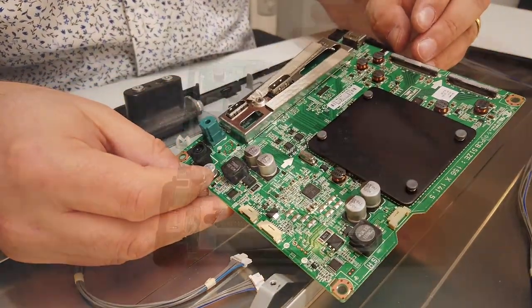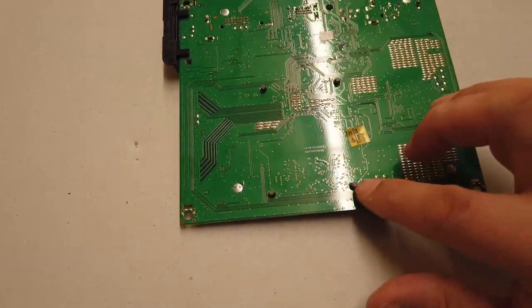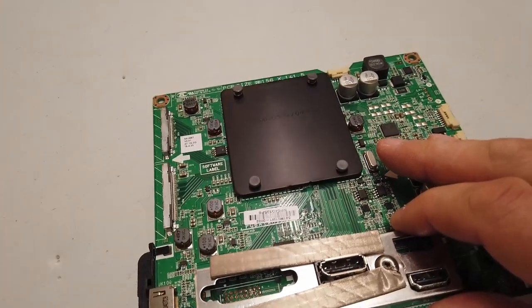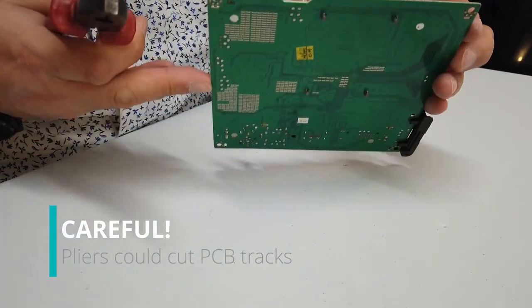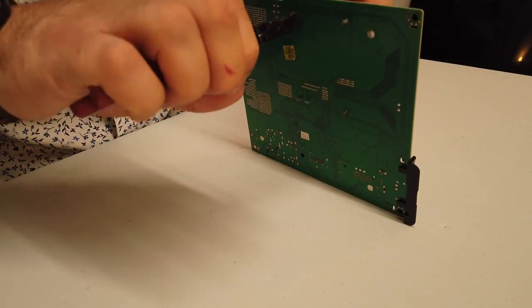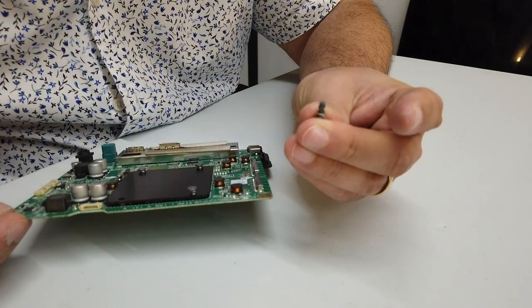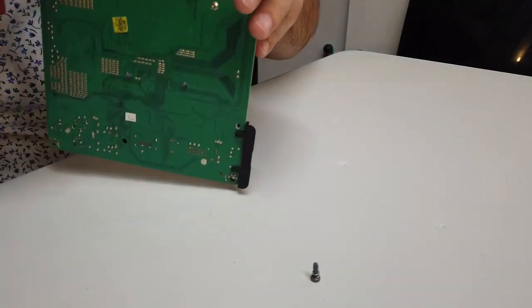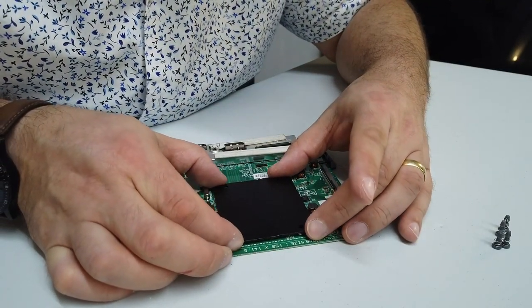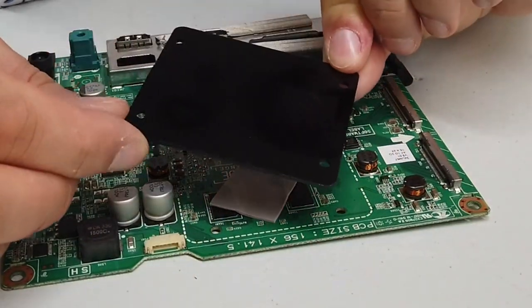Let's have a look at this PCB. This heatsink can easily be removed — there are some little plastic tabs here, and if we pop these tabs out we'll get the heatsink off and see what is driving this LG monitor. These little plastic tabs have got little expanding mushroom hats that pop out and keep everything in place once inserted. Now we've got all those tabs out, we can carefully lift up one of the corners — and there we have it.